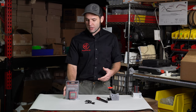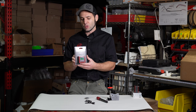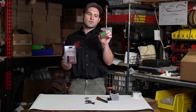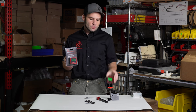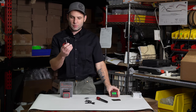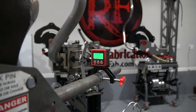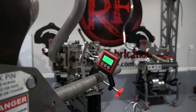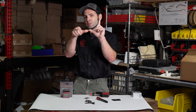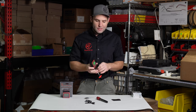The degree indicator is the first part. This is a digital angle rotation cube, and it's backlit. I've got one out of the box here with batteries in it. This measures rotation, and you can use it two different ways. One is with the included cube clamp that we sell — that'll clamp onto tubing, and as you rotate the tubing, it'll tell you how much you're rotating between bends. That's critical when you're putting rotation between two bends, making parts that won't sit flat when you're done, or making sure your parts will sit flat when they're done.